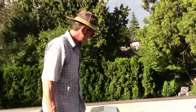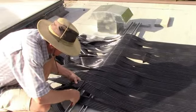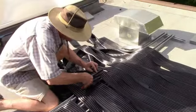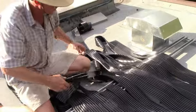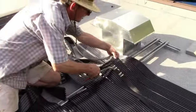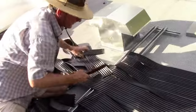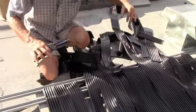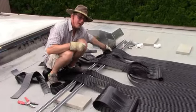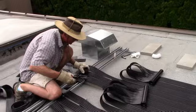So we're going to cut. It doesn't really matter which ones are the outers, so let's call this the outer — we're going to cut that one. If we cut the outside ones first, then we can't make a mistake. Those would be the inside, that's the outside. That's how the cutters push them in and never move them. Inside, outside — push them in all the way and don't move, because you don't want to nick the thin tubes. So now we put these three headers on, flip these out of the way, and then we cut these. That's key, because we don't want to make a mistake. So we've done those three, we flip them out of the way, and then we cut our inside line. There's no risk we're going to cut the wrong tube this way.